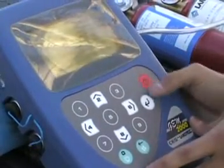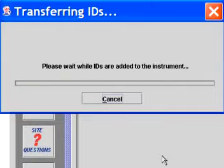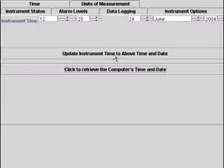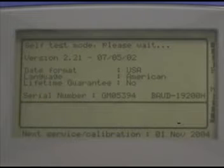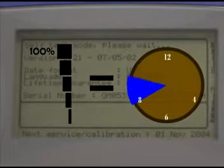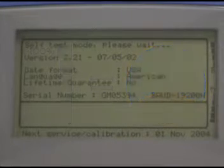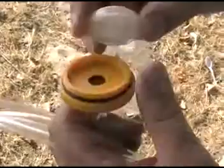You should have already calibrated your GEM in the field. You should also make sure that you used DataField to load your monitoring point IDs and set your time and date. Your battery should be charged. With normal pump use, a fully charged battery will last about eight hours. You should have enough free memory to store your readings, and your hoses and filters should be clean and clear.